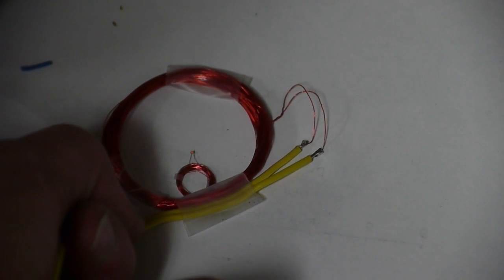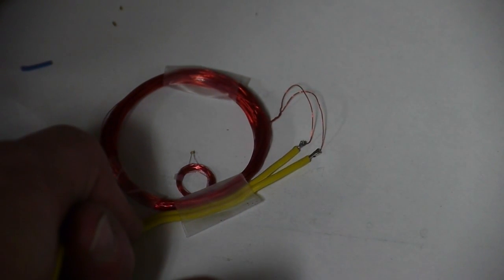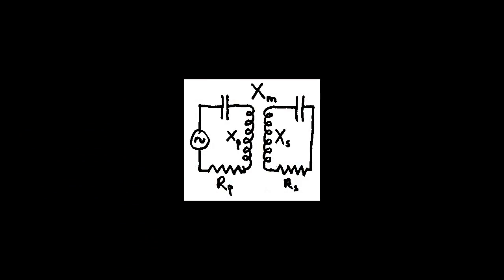The way I planned to power this circuit is through plain inductive coupling. I originally wanted to do a tuned circuit and have a capacitor inside the contact lens as well — the best way of transferring power through a large airspace is with a resonant inductive circuit. Unfortunately there's just so little room inside the contact lens I went with just a straight coil. The coil is connected directly to the LED, and for half the cycle power won't flow, and through the other half power will flow through the LED and we'll get some light out of it.